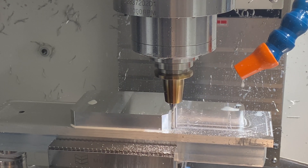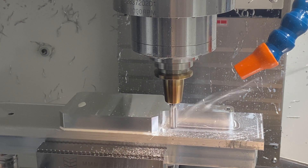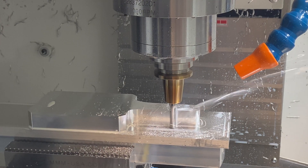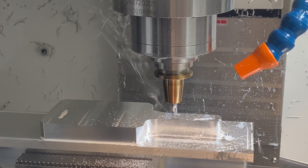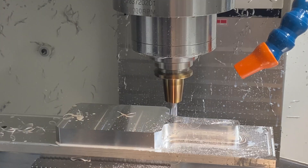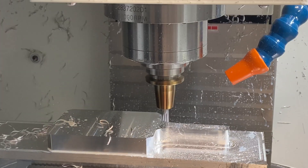When you have the ability to take a cut like this, a solid carbide tool is ideal. You want to match your tool to your material. These solid carbide tools tend to be really sharp for aluminum and are really polished for good chip evacuation. You can see we're taking these cuts with absolutely no coolant whatsoever, and it's doing okay — but if you tried this with a tool not designed for it, you could very easily weld a chip into that tool if your feeds and speeds aren't absolutely flawless.